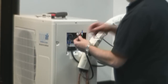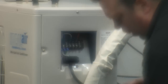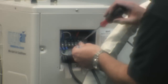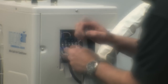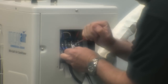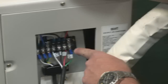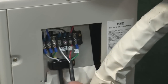Take the control wires that are color coded and numbered — they'll come up inside the outdoor unit panel. The grounding lug is the only one you have to completely remove from the unit. Take number one, which is red to red. Take black, which is L2. Take white to white, which is L1. Your electrical components are hooked up. As you can see, it's easily numbered with color-coded wires — red to red, black to black, white to white. Very simple, very hard to make a mistake when you're doing this.